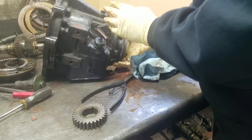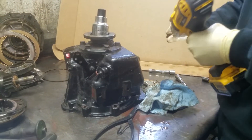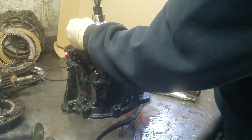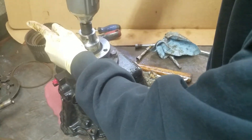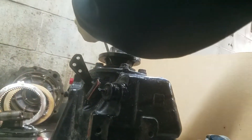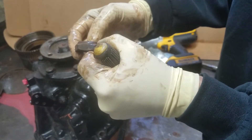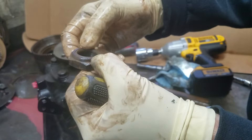Now we're going to pull the coupling of the planetary off. We'll put a lever on it with a screwdriver here. It's best to buy a new nut, though I have in the field before used Loctite because of the nylon locking ring — it's really not meant to be reused.